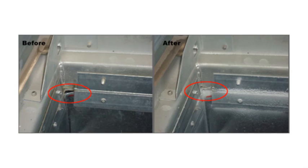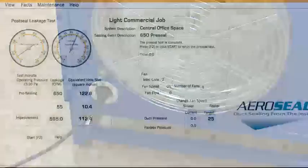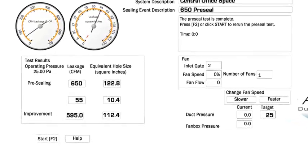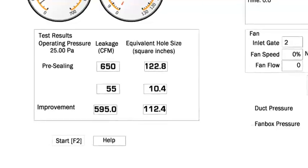The AeroSeal technology uses a fan to blow small dry adhesive particles into the blocked duct system. The particles move through the ductwork at a constant rate of speed. As the particles approach a small hole, the air is forced into the small space as it tries to escape the ductwork. The particles stick to the side of the hole, and as more and more particles repeat this same action, the hole is soon filled. AeroSeal can seal holes as big as 5 eighths of an inch without coating the ductwork. You will want to run scrubber fans to clean the air in case of any overspray. After taking the initial leakage rate prior to sealing, we must now take the final leakage rate after the process of sealing. This report tells us how well the process worked.